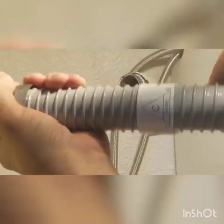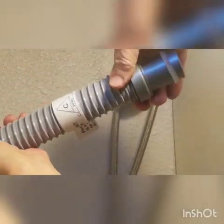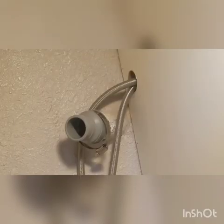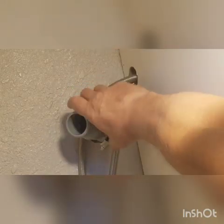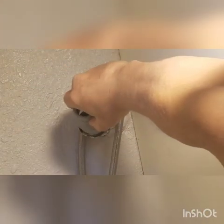Let's push it back to kind of where it was. Snappy Trap comes with two different ways to adapt your drain. There's this wall drain coupling, which comes with a hose clamp for the back side of two-inch, which slips over. So this slips over — get it snug, put on your hose clamp.